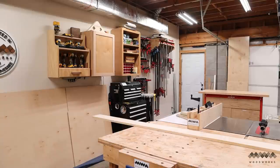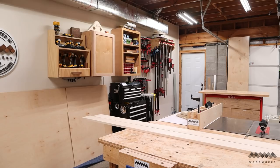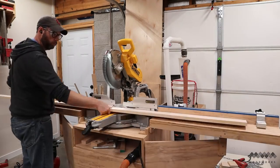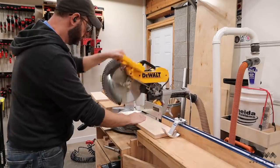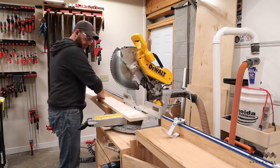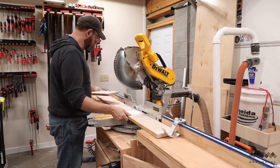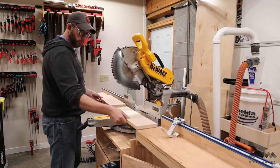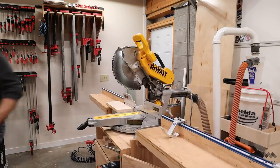For the drawer boxes and all the trim pieces, I'm going to be going with solid wood. For painted cabinetry, my preference is always to use hard maple. The reason I like hard maple in painted projects is because it's a very tight grained wood, so you don't see any of the grain structure coming through your paint job. And since hard maple is a really dense and very strong wood, it can take a good beating on things like kitchen cabinets. This kitchen island is going to get a lot of use over time, and I want to use something that can withstand that abuse.